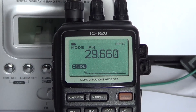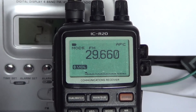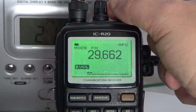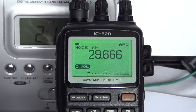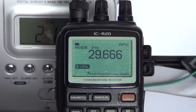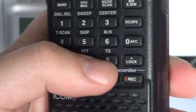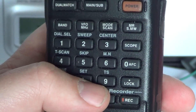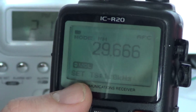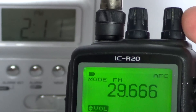Now, how do you change the tuning steps on the radio? You can see the current tuning step just by going to the upper right dial button - if you turn it clockwise, you see it changes in 1 kHz increments, so the channel spacing is currently 1 kHz. To change that - maybe you want ultra precise 10 Hertz - you use the TS button, which is the number 9 key on the keypad. Press and hold the 9 button and the display will say 'set tuning step.' Then turn the right dial button.